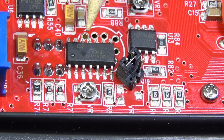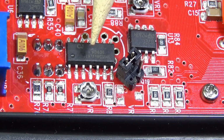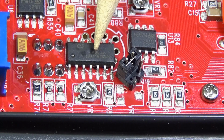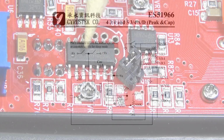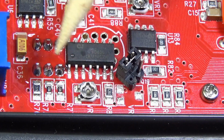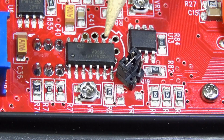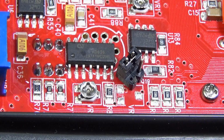Now, if you want more precision, you can customize your chip and go for the one with more precision. But I have some advice for you. Two things will happen. Number one, you have to adjust this chip yourself, so you have to calibrate. Number two, it doesn't matter the precision of the chip if the next stage later cannot assimilate the precision of this chip. So in that case, it's better to use the J model and just adjust and trim it here. So the precision required they already got by adjustment, and we made the measurements and it was right.